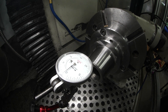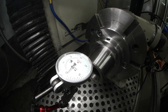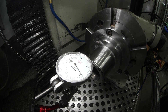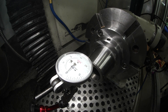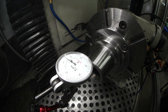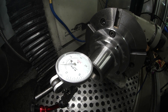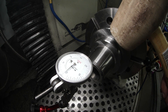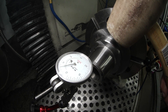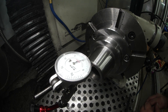Let's get this puppy dialed in. I've gone ahead and set the dial indicator to about the middle of the sweep. It's about a total of 15 thousandths off — yeah, about 14 to 15 thousandths off. That's not our high point. I like to put the key nut right at the top where I'm going to whack it with a hammer. DRO shows it to be 180 out. Grab it back to the middle of the sweep and we'll get it tightened up. Looks like we're back in business for some manual tool changes.